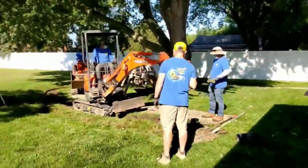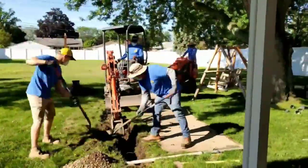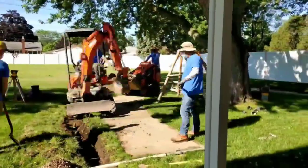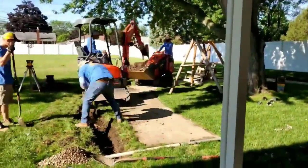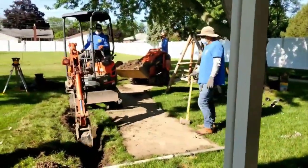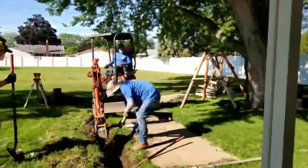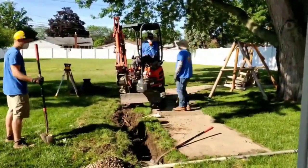You can see the stone — they're digging right where our French drain ended years ago. You have to hand-dig when you expose your system to make sure you don't contaminate it. When you find it, you cut your drainage fabric, remove some drain stone, expose the pipe — it's a super easy tie-in, you can just tee it in, not a problem whatsoever.